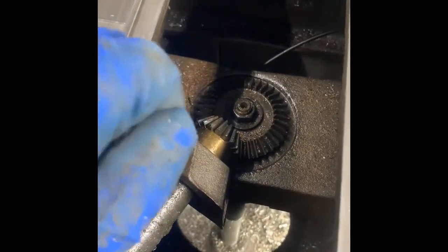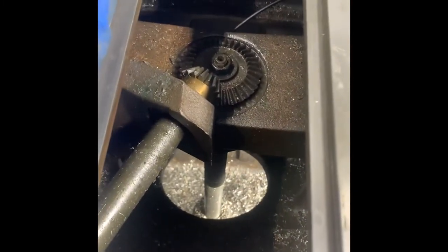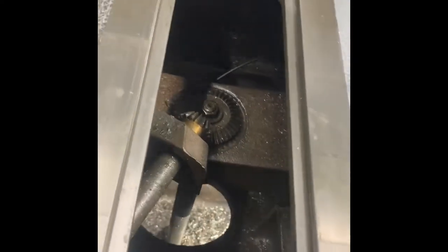On the service jobs, I do not completely clean this cavity out. I blow all the chips out, scrape them out as best I can from the top, and make sure the gear assembly is free from chips — but other than that there may still be some remnants. On the rebuild jobs, the whole knee comes off, gets completely cleaned out, and I actually paint the inside of the castings. But not on the service jobs.